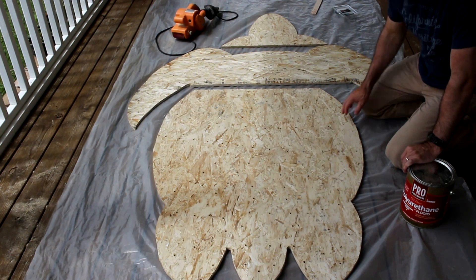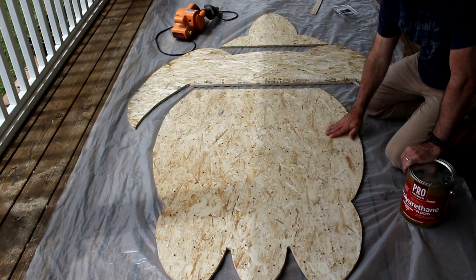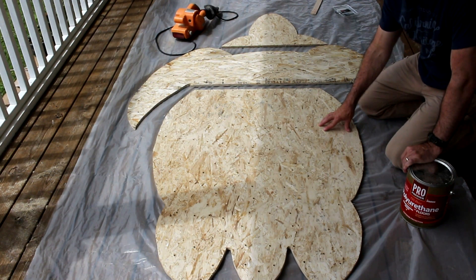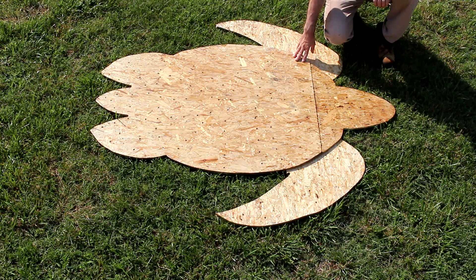All the drilling is done and before I applied the polyurethane I went ahead and hit it with a belt sander to smooth it out. For the sealant I decided to use a polyurethane — I'm going to apply five coats to every side. It did take all day and night but the wood is finally dry and it actually turned out pretty good.